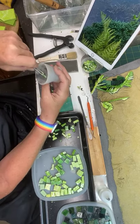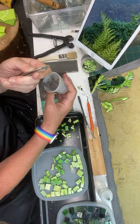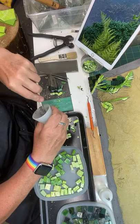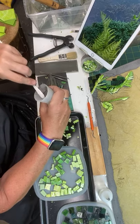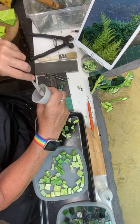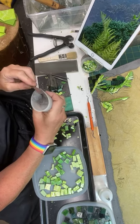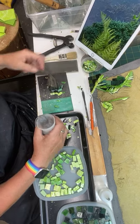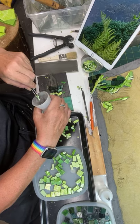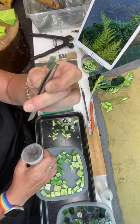All right, so here's an example. When your thin set's too dry and you dip it in and you barely get any thin set, then there are two things you need to do. First is re-stir it and just keep stirring until you get the softer, wetter consistency on the top. So I'm just kind of pushing down like this. This is almost at the end. I really only have a little while longer to work with this, and then I'll scrap it and make a new batch, because it's good to have the right consistency. There we go. Perfect little squish.